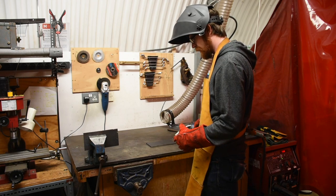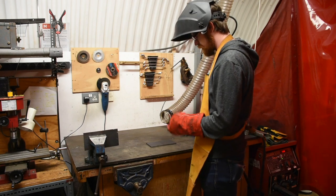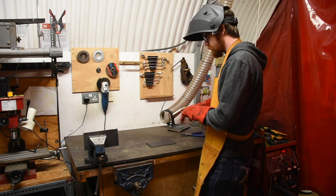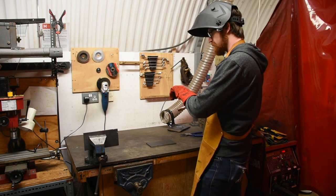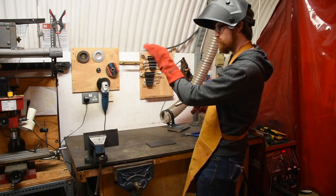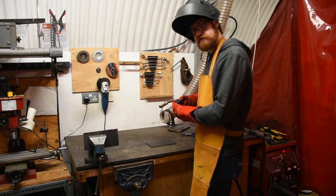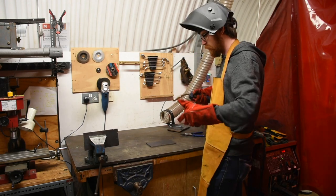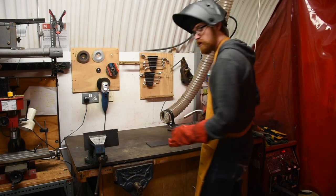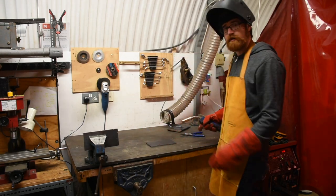You'll get used to one way or the other. People naturally think they prefer to pull, but honestly for beginners it's quite often better to push. You can try both and get a feel for them. As we're welding, the main focus is manipulating what's called the weld pool — the molten area of metal you'll see through the visor. Some people like to do C motions, some rock back and forth — there are lots of different techniques to slowly advance the weld pool through the material. When we're putting in the right amount of heat we get good penetration. We want to make sure the weld is joining deeply into both materials without burning through, and looking at the backside of our welds will be a good indicator of penetration.